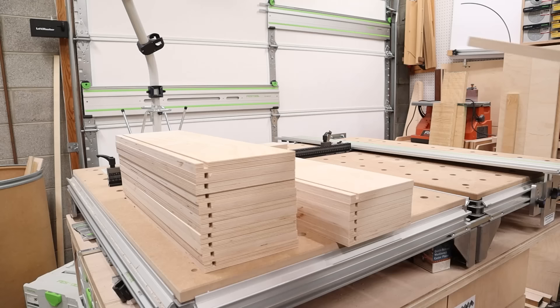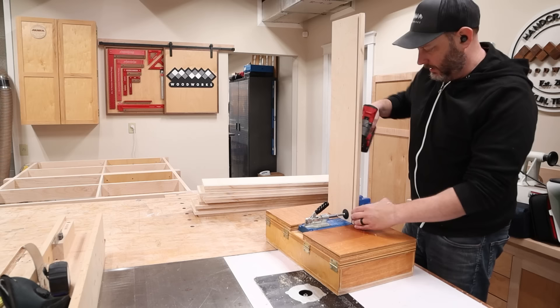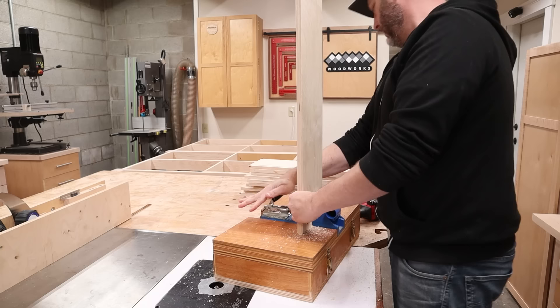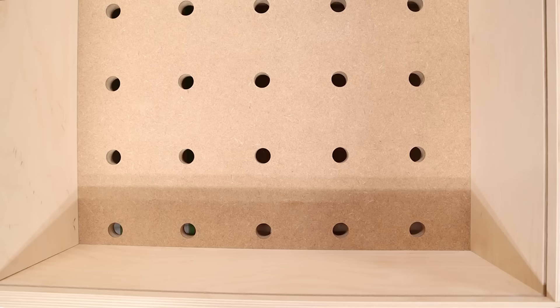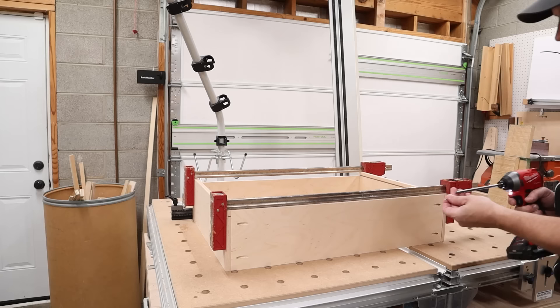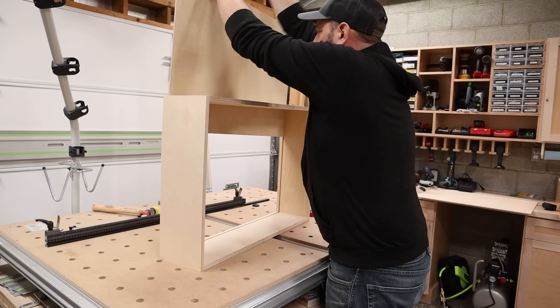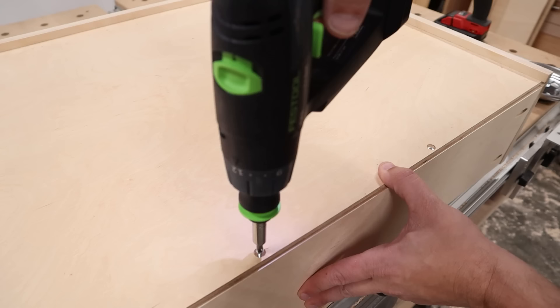For all of you who may be thinking that I'm some kind of elitist woodworker who only uses Festool, you can think again, because I love using pocket holes to build all my drawers. I think this is the perfect application for them — quick to do and all the pockets are hidden. Even my solid maple kitchen drawers have pocket hole construction. For drawer assembly, I adhere to the KISS model: just keep it simple. With my parts aligned like this, they fold up and I can align the joints and make sure they're nice and square before I add a pair of clamps. I pop in my pocket screws and I find glue to be optional here. If you did add glue to these, just make sure to tape off the inside of those joints so that the glue squeeze out is easy to remove. Then I can just slide the bottom in from the back side and tap it into the groove in the front of the drawer. I like adding screws here, especially for shop drawers, because they're going to end up holding a good amount of weight.